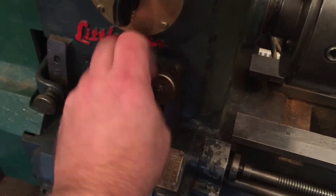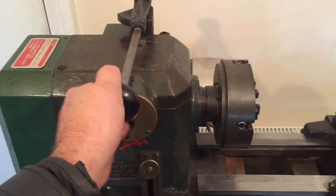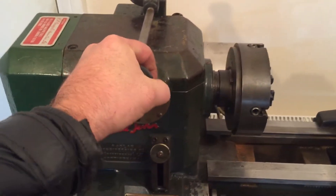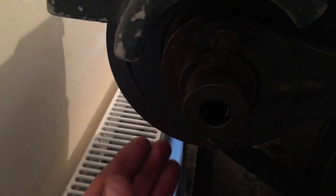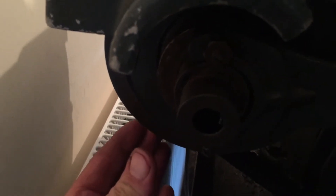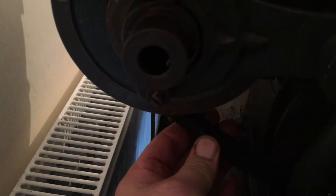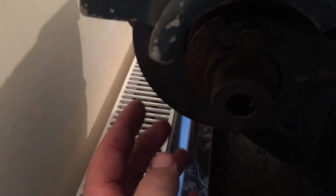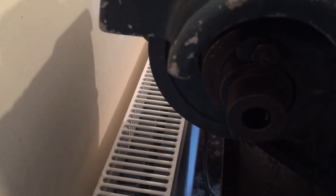So let's just make sure we don't leave that on. I thought I'd just show you that because you could be fooled into thinking this doesn't work if you try and adjust it when the machine isn't running. The way it works is it adjusts the pulley on the back of the motor and either squashes it or makes it go wider. If it squashes it, the pulley band goes up, which in effect changes the diameter, which makes it spin faster or slower.